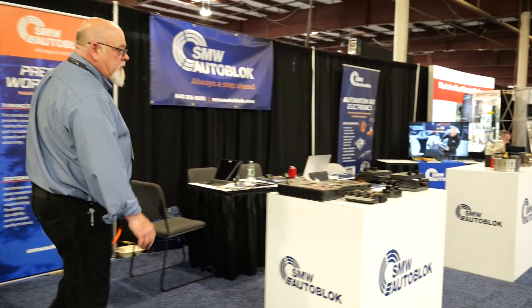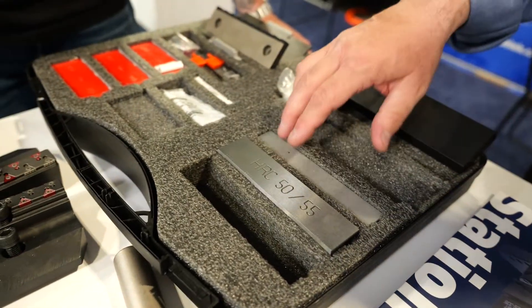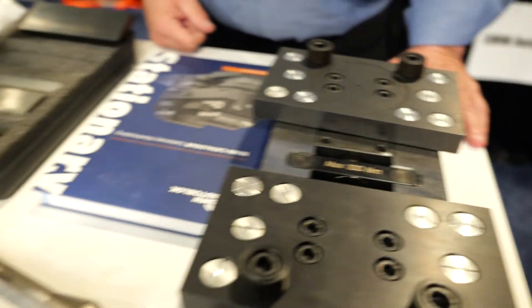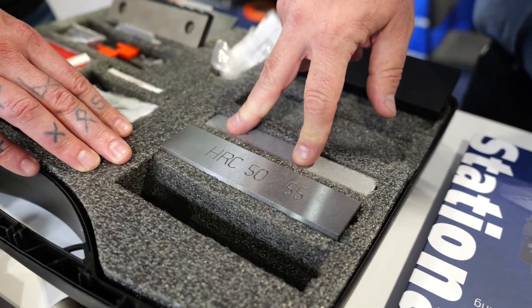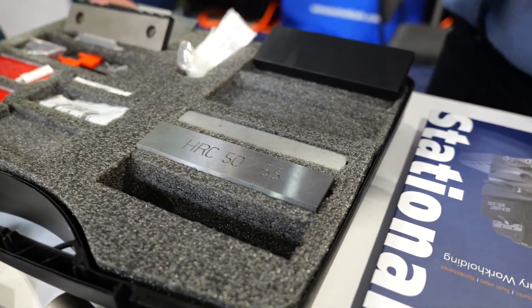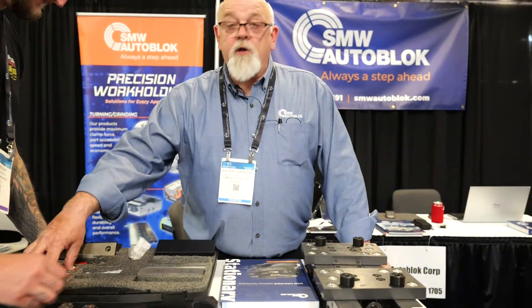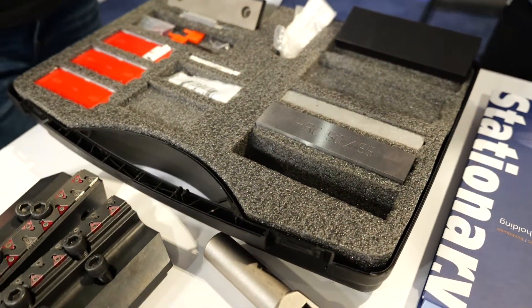Down here, this is our Synergrip kit. This is what our salesmen carry around to explain how Synergrip works. We have different materials in here, all the different brands, the inserts that we use and how they're used in our vices. If you wanted to buy these inserts and buy a cutting tool, you can make your own clamping jaws and your own vices if you want to. These work up to 49 Rockwell for aluminum and soft steel, and then after that we use a different insert for harder materials — stainless, Waspaloy, Inconel, all aerospace components. The inserts are all the same carbide grade; they just have different patterns in them, because each material has a different tensile strength you're dealing with.